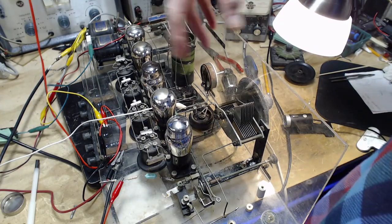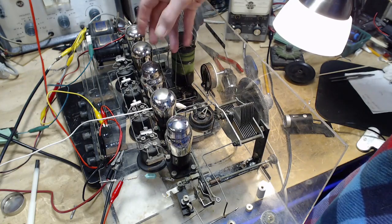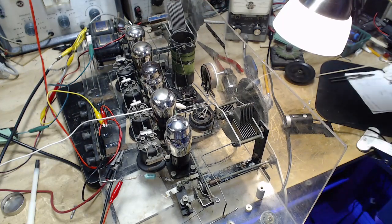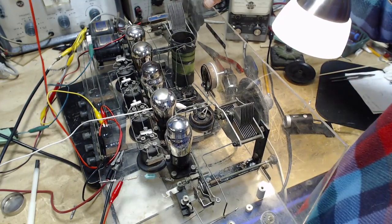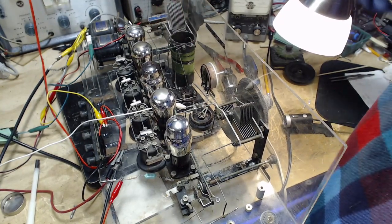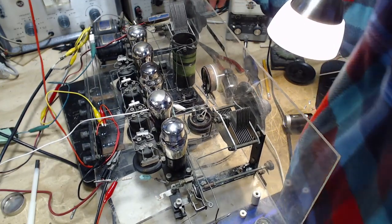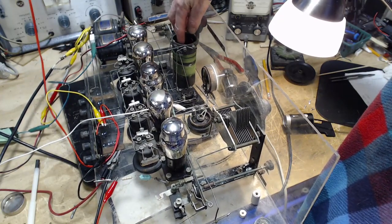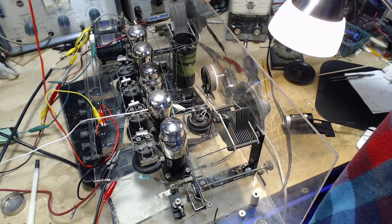It's a pretty common thing in these 1920s vintage radios to have coils inside of coils that would rotate. I think one of the words, a variometer, is one of the terms that was applied to it. And the idea is if you do it right, you can actually make quite a variation in the inductive impedance in these coils by doing this. Where it is, a slight touch on this can make a big difference in the operation of the radio. But obviously this isn't something you adjust over and over. You adjust this once and you tend to leave it alone after that.